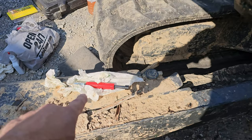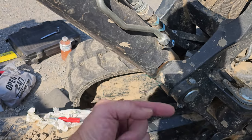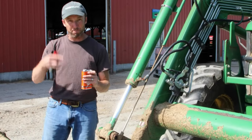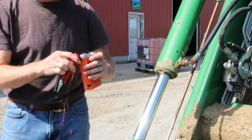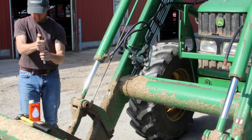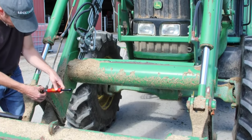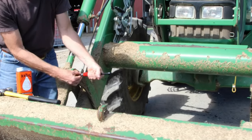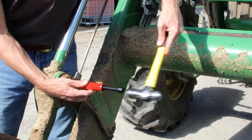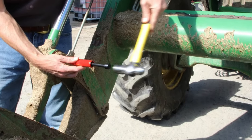I replaced it. I've used the grease buster, pulled the zerk out, shot PB penetrating oil all up in there, and it's still not taking grease. This video is courtesy of Lock and Lube — that's the kind of grease buster I've got. It's an empty piston you fill with penetrating oil or diesel fuel, put the cap back on, place it on your stuck grease zerk, and hammer it very lightly. You don't want to sledgehammer it — the vibration is supposed to work in your penetrating oil and break through the clogged grease zerk.